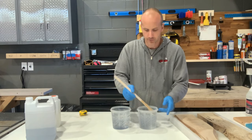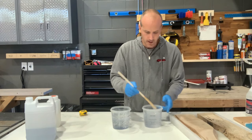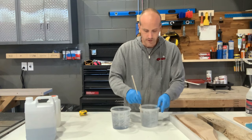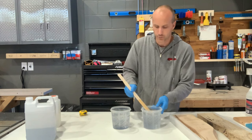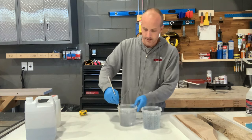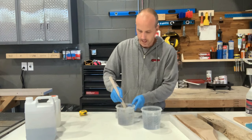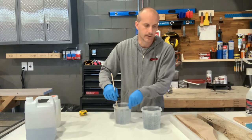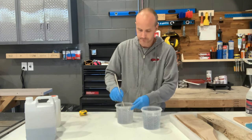I don't have one of those. I don't really see the need. I don't do a lot of these boards. I do them mostly for demonstration of our molds. I used to build a lot of boards, but that was a couple of years ago. Now we build a lot of kit stuff, and we also import a lot of home products. But besides the point, you can do a good job if you just mix this gently, and then make sure you get all the bubbles out of the surface of your pour with a heat torch or a heat gun.